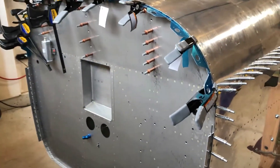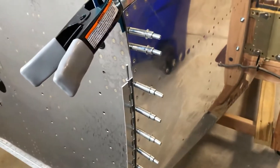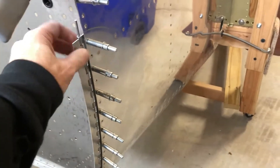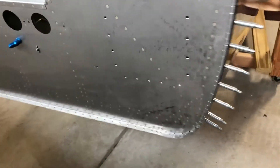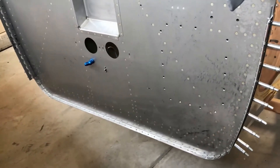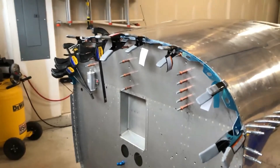I'm going to try to find cowling dimensions to see how far down it goes, but I like how this is looking. The hinges have been deburred and dimpled — the pin comes out pretty easy, and once I bend it over it'll be straightforward. The only thing left is down at the bottom: instead of a hinge there I'm going to use nut bolts so you can just screw them on. The bottom cowling doesn't come off very often, so it shouldn't be an issue. I just need to get material to fabricate it — probably something about the same thickness as the existing brackets.